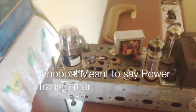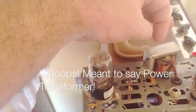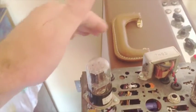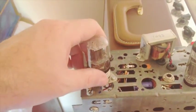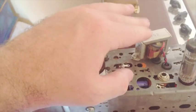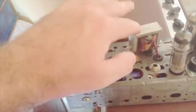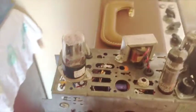Here is the output transformer fitted to the original radio. It had a little 6-inch oval speaker, and the transformer was pop-riveted to the back of the speaker as was done in the early years. I drilled that off carefully not to puncture the cone. I worked out that a 4-ohm load presents a 5 kilo-ohm primary impedance for the EL84, so it actually suits. It works best at 4 ohm — you don't want to go any lower.